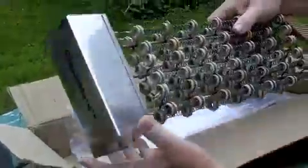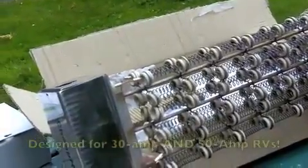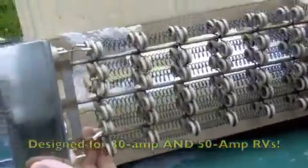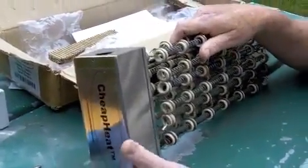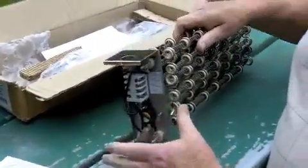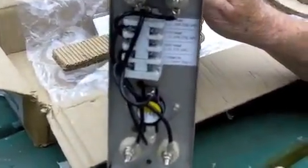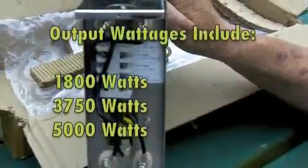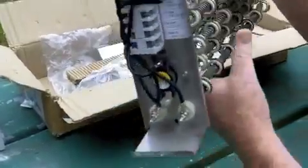The next thing we need to discuss is the heater coil. This is the heater coil — you've got one heater coil that operates at three different heater settings and two different voltages. It's really unique in that it does all those. This is a patented coil and we are the only ones that have this. The technician just has to slide in a wire, twist the screw, pick which heat range you want, slide in the other wire, twist the screw, put the cover back on, put two screws in it, and he's done.